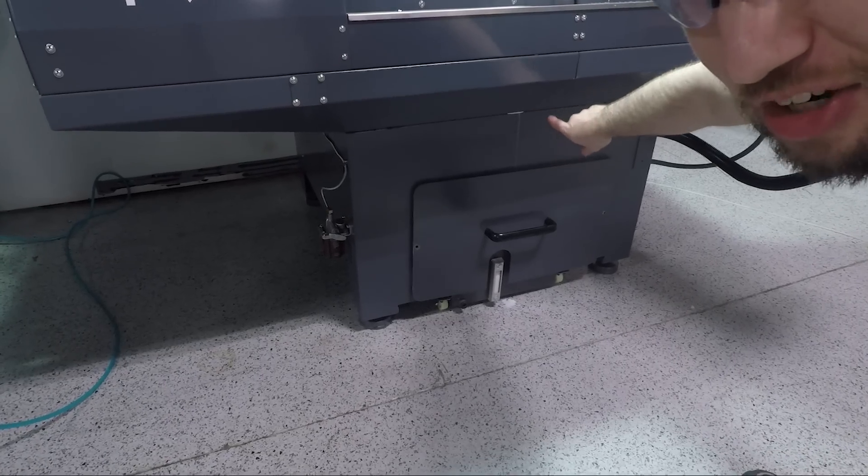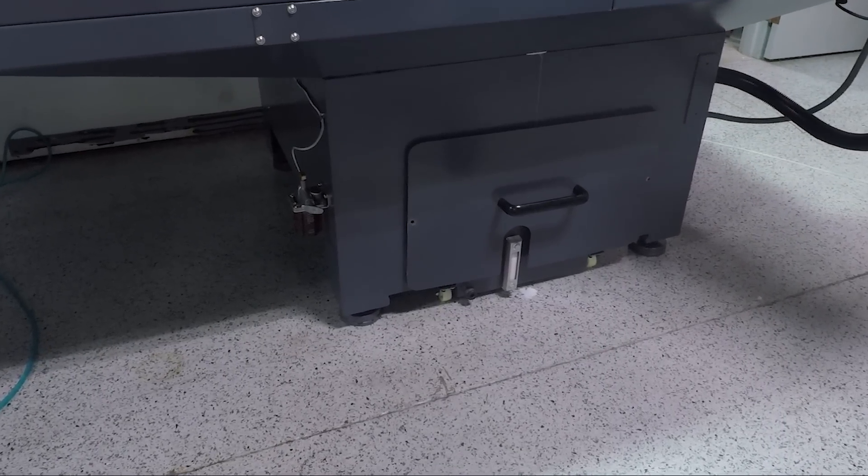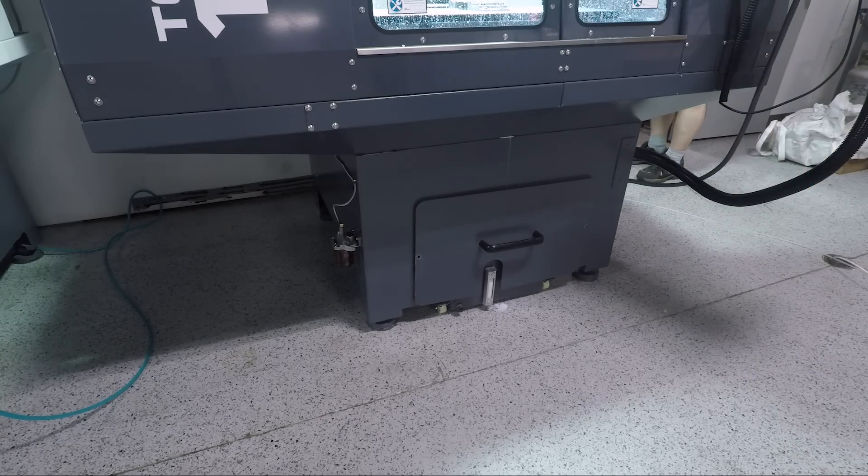It was at this point that Ed noticed several small coolant leaks appearing at the base of the machine. But this appears to have just been the result of having not quite enough butylene sealant in the areas where three-panel joints intersect, so once we shoved a little more of that in there, things dried right up.